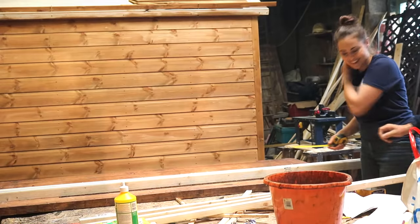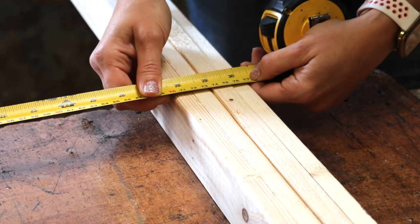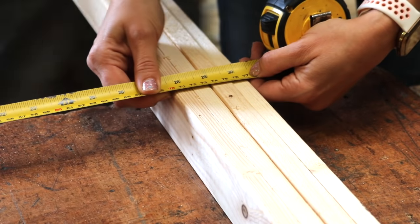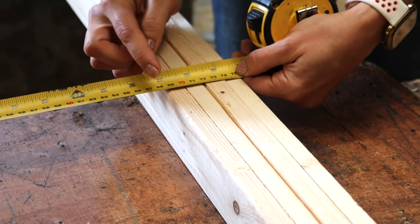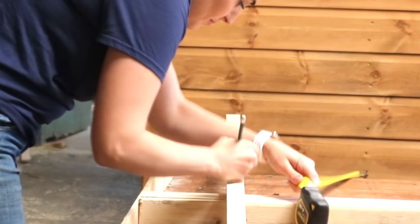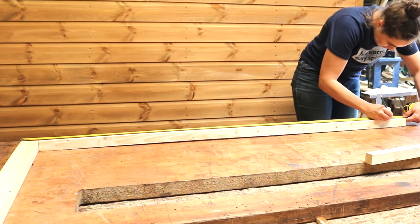Time to go back to the woodyard and build the door. An easy way to do it is push together the two trims of the door opening and two for the door's trims. Measure the width of your shed's untrimmed door opening and line that measurement with a tape measure on the gathered trims, then pull it back by the amount of clearance — in this case, 15mm clearance — and that gives you the width of your door frame. For the height, I measured the opening and reduced it by about one centimetre. The cladding at the bottom will overlap again like it does with the rest of the shed.